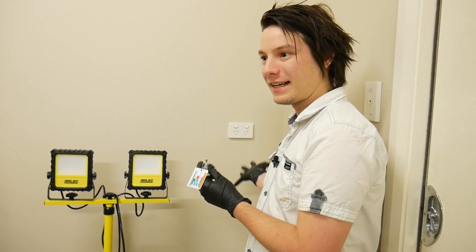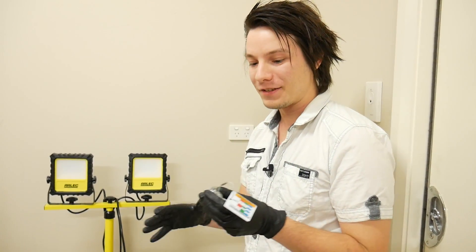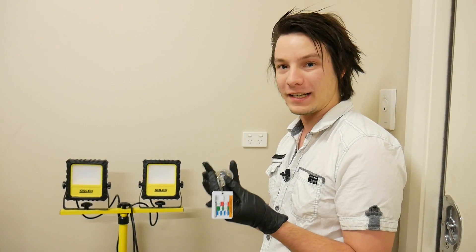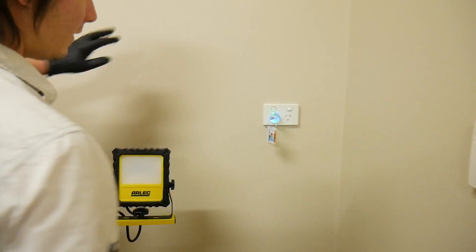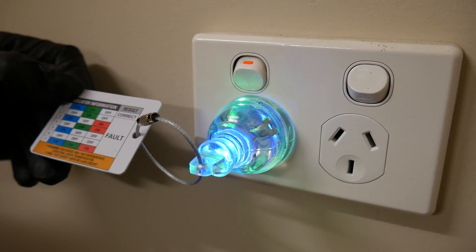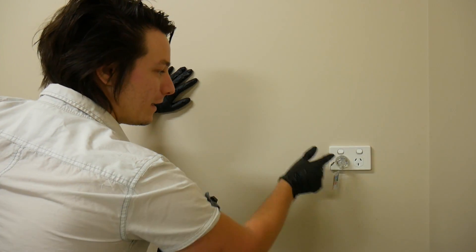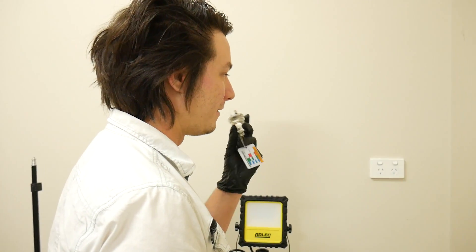This is the powerpoint I was using for my tests where I had the issue, because I was using dodgy daisy chain power boards — which, again, never ever do. The purpose of the fault detector is to figure out if there's no ground connected or any other kind of mains wiring issues. You just plug it in and turn it on, and in my case there's a blue and green light which indicates correct wiring. If there's red or any other sequence, there will be a fault. It's a really cheap method of testing for faulty wiring, and because we move all the time here at Makers Muse, I'm going to use this to test every single mains outlet in this place.